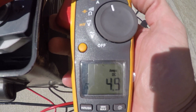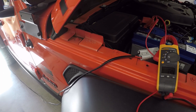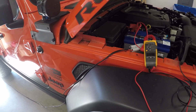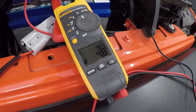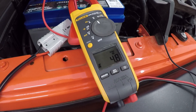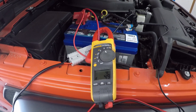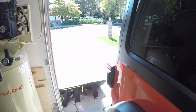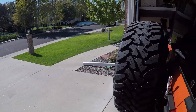I'm going to leave the thing hooked up to the Jeep for a little bit and just let it run, see how long it takes to bring it up to a full charge. It's only been on there about five or six minutes right now. It's still pumping in — bobbing up around 4.8 to 4.9 amps on the current, so we're getting almost a 100% rating from this 100-watt panel going right into this battery. It just snowed here and there was three inches of snow on the ground just a little bit ago, but it's a beautiful 50 degrees outside right now.